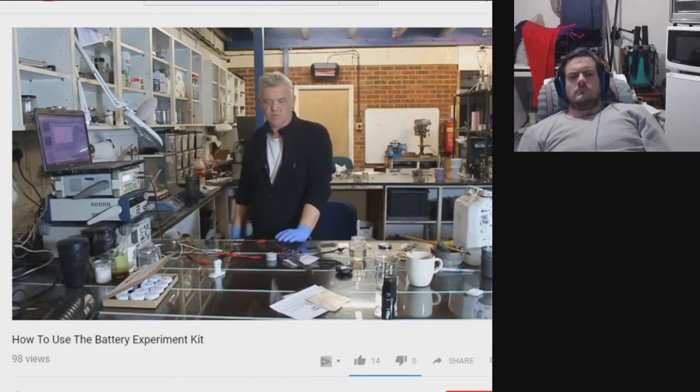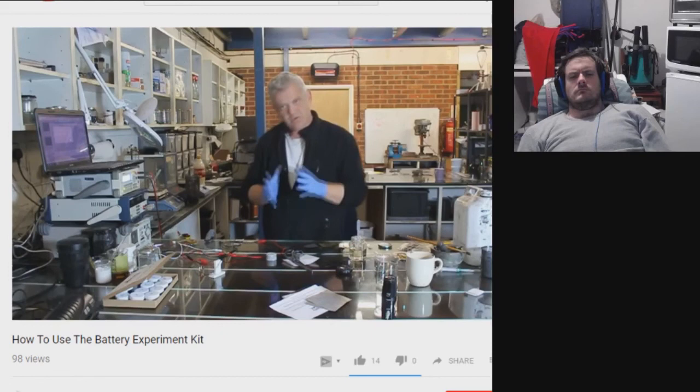So we turn that motor for a few seconds, putting a little bit of charge on it, but it's a symmetric capacitor. Now, symmetric capacitors, remember, are very power dense. That is, they're able to release their energy very, very quickly, but they can't hold much energy. So what we want to do, really, is put in a system whereby we can hold more energy. Now, there's a cost to pay for this. When we do this, we lower the power density, but we can increase the energy density, and we tend to reduce the life cycle as well.